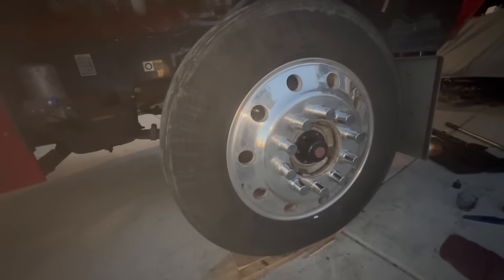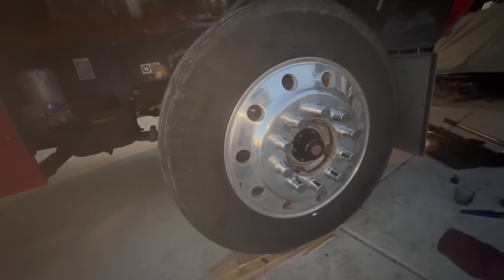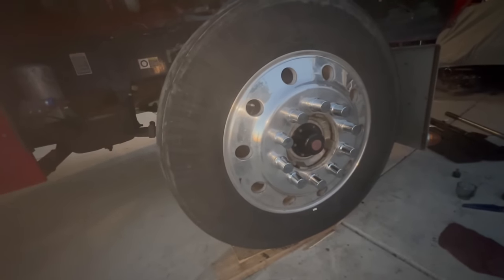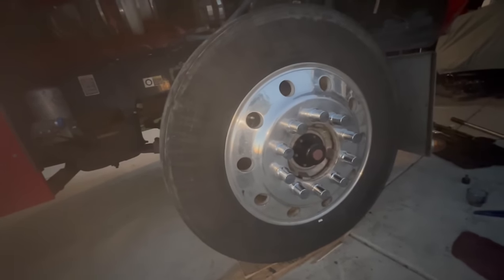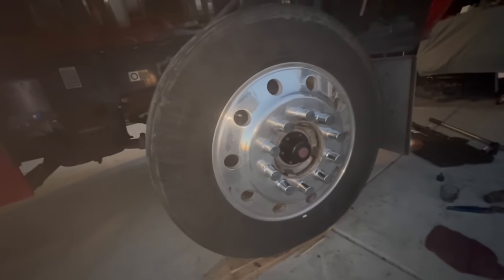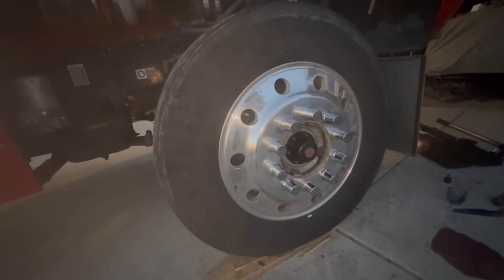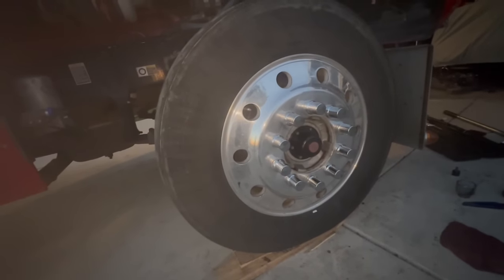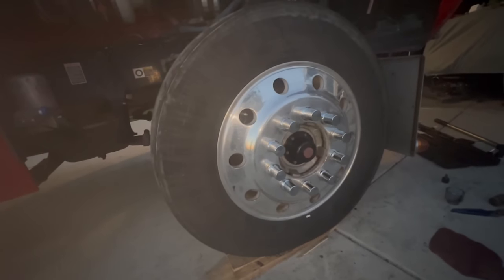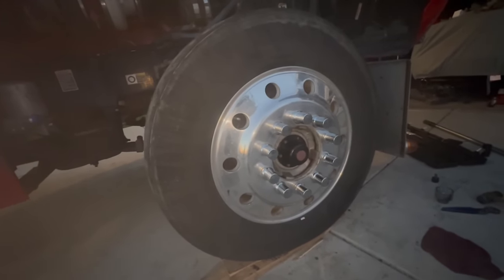Disclaimer. That inner nut that we torque to preset the preload on the bearing is 300 foot-pounds, 250 to 300. So I made a mistake. That outer nut, the lock nut, the jam nut, the smaller one, is 200 to 250. So 200 plus 50 max. So I made that mistake, and I had to correct that.